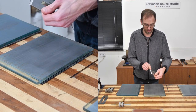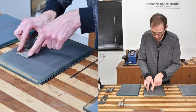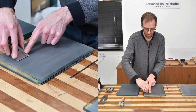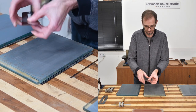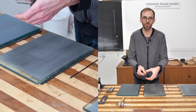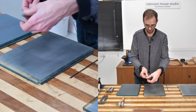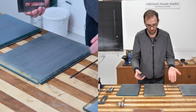I find that quite a quick way to do it because this is a nice thick blade — there's a huge distance between the heel and the tip, so it's quite easy. I sometimes pull it back the other way, but sometimes it judders. I tend to do that with finer grits. The coarser ones are for getting rid of material efficiently. Do that for a bit and feel for a burr — a bit of material that's been folded over. Do not run your thumb that way; run it forward over the top and you'll feel a piece of metal.